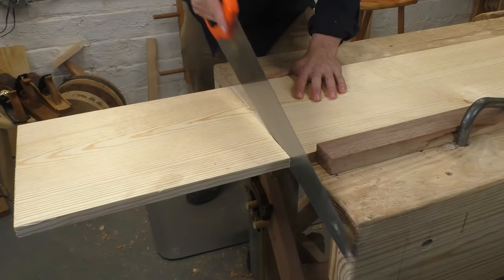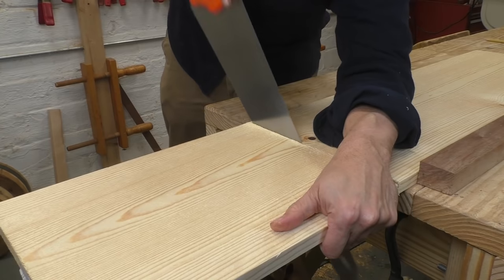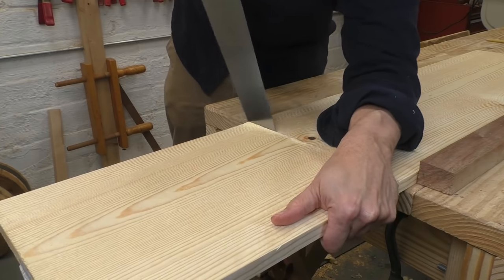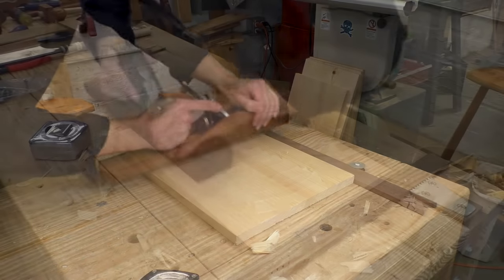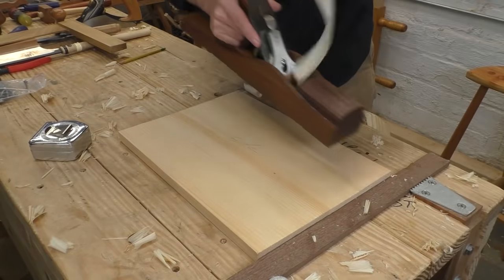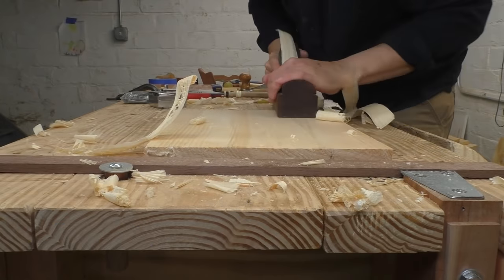The bottom is the length of the lid minus the thickness of the sides, but we're going to be dialing in the fit later, so don't trim this board — leave it long. If you have any ugly wood, try to use it for the bottom where no one's going to see it. With everything cut to length, it's time to flatten the stock, and this is kind of a balancing act. All of my boards cupped a little and they all need to be flattened, but this cheap lumber is only three quarters of an inch thick.